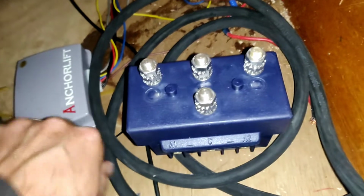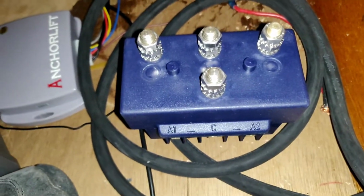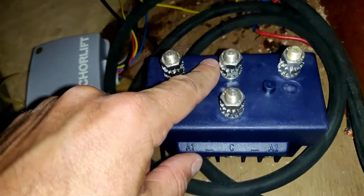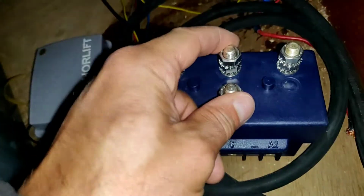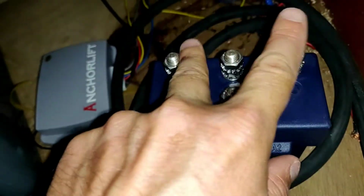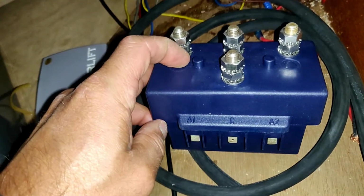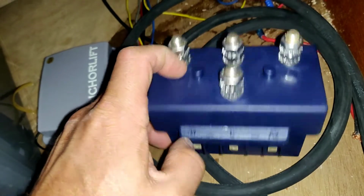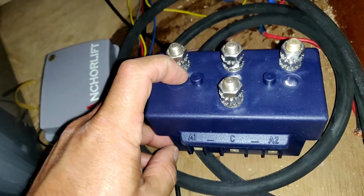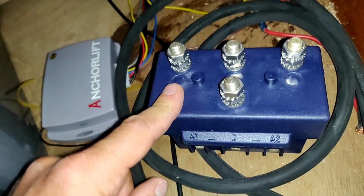Okay, just had a look at the Lofrans Kobra wiring schematics, and it looks fairly easy. We should have a battery positive, battery negative, and windlass positive or negative, either way we want. And these guys are for the foot switches. So common negative, and a control cable to the up and down switches, and we just put a common positive for the switches here.